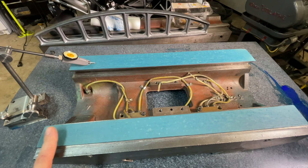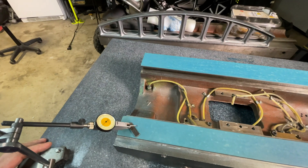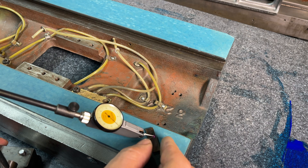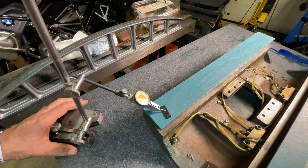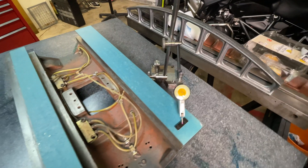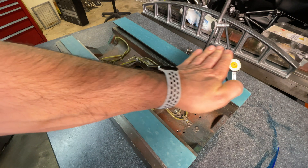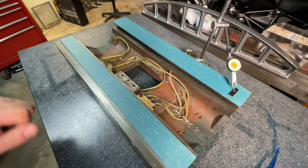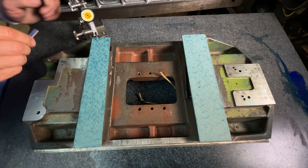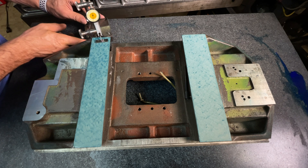Now this side is dialed in and I'm almost done with the back side. Before I finish, I just want to make sure to zero it up here. Coming to the other end — this side is up by one thou but that's up by two thou, and this is almost three. Basically we have a slope going on, but that's not from this surface, it's from the back surface. I'll flip the part and double check — it checks out. So this should be our lowest point, I'm going to set that as zero.